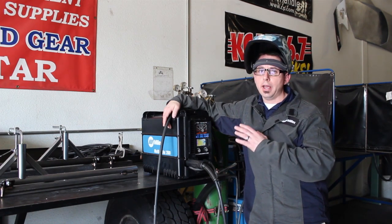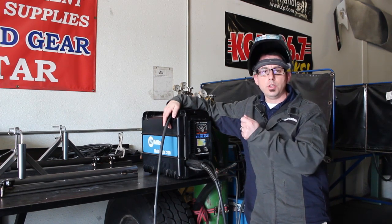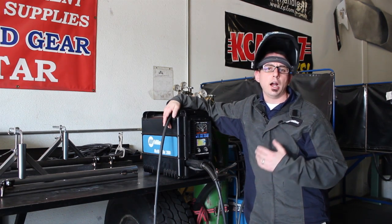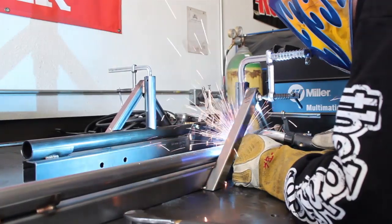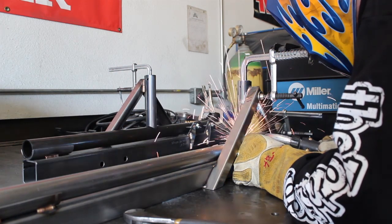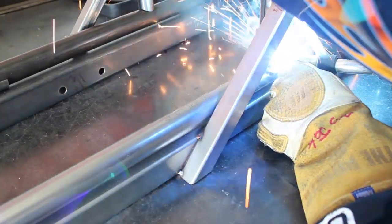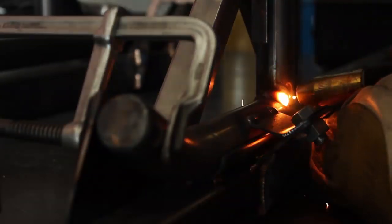The reason I'm mentioning that is because the technique is going to be different than you're probably used to. Normally you'd see somebody straight weld all the way around. In this case we're going to be using a manual pulse weld technique — pulsing the MIG gun. If we had the machine set for the proper setting to straight weld it would be too cool and we'd have a greater chance of cold lapping. So we're using the eighth-inch setting to melt in the material, pulse it all the way around, and overall add less heat into the base material.